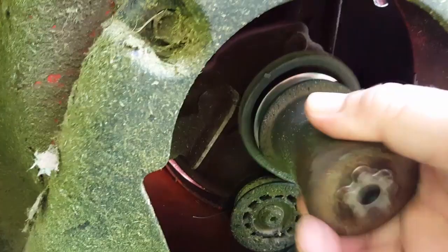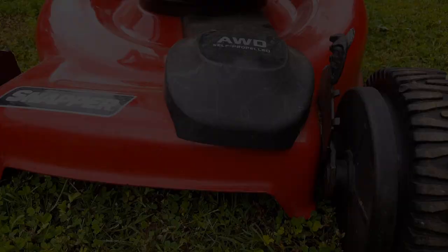It's very clear that the key has sheared. As you can see, it's still in the keyway and the inside of the pulley is completely smooth. That means we'll just have to wait and get a new adapter to fix this.